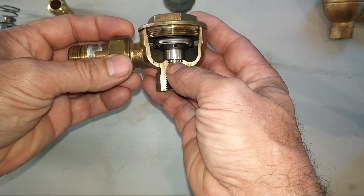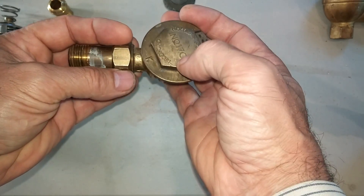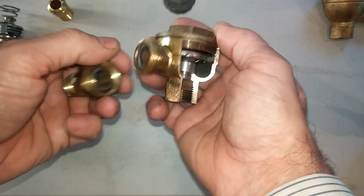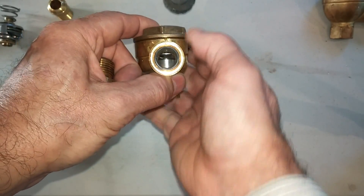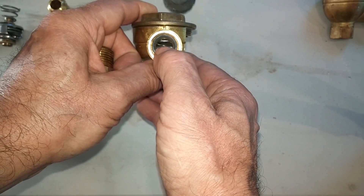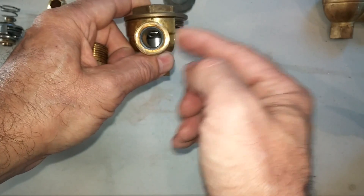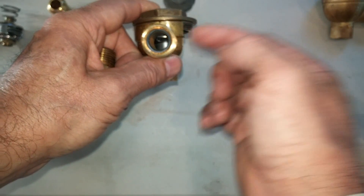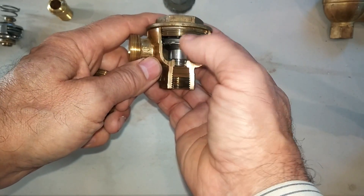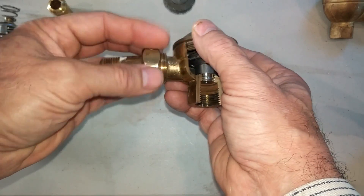The other reason I do not like the design of this Durastat in the 17C is that it sits up very high in the trap. As you can see, the water return is going to have to back up to nearly two-thirds before it starts draining. I've heard these things gurgle under normal circumstances, so a lot of water starts backing up into this trap before it starts draining, which is another thing not to recommend it.